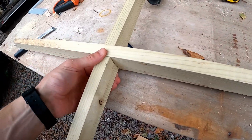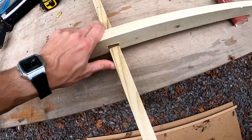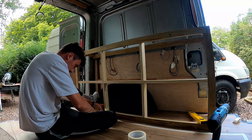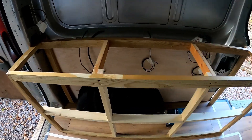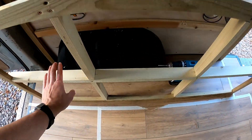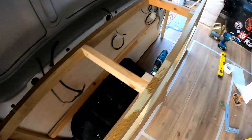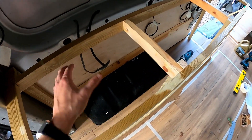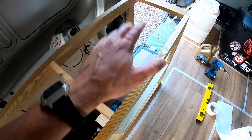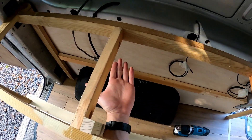Hopefully this makes more sense now — you can see how that basically fits in like that, and the same here. This is where we're up to with this unit. We've got the structures on the front now and we'll put these two in here. Essentially, there's going to be a worktop sat on here on hinges on this back part, so when you lift it up you've got three shallow storage areas — one for batteries and loose items. What I'm going to do now is put the 12mm ply on the underside, so I'm just measuring that up and we'll put that on.